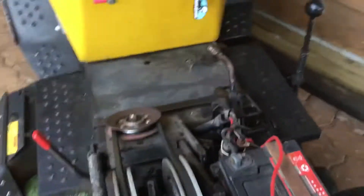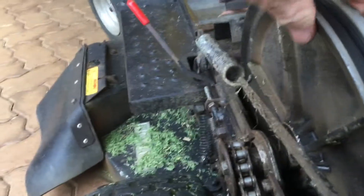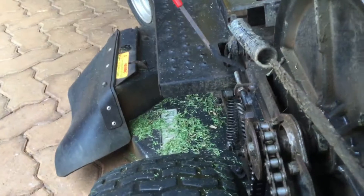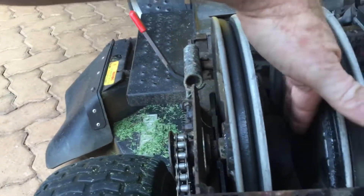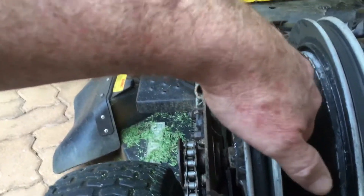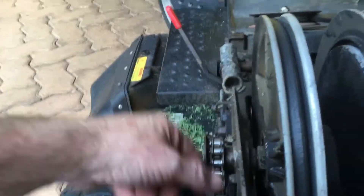Getting back to the drive system — so that's how it works. You've got a bearing in there, a bearing there — these are bearings. You've got a shaft, and these ones here are continuously turning. It just moves either way to forward and reverse. These are aluminium, and all that does is there's cork on these. When that moves across, it's just no different to letting the clutch out on your car and the clutch plate closing up and pressure just going on it. The amount of pressure you exert on them is what you put on with your foot as to what speed you go. Obviously you have slippage in them until you have it pushed right up hard.